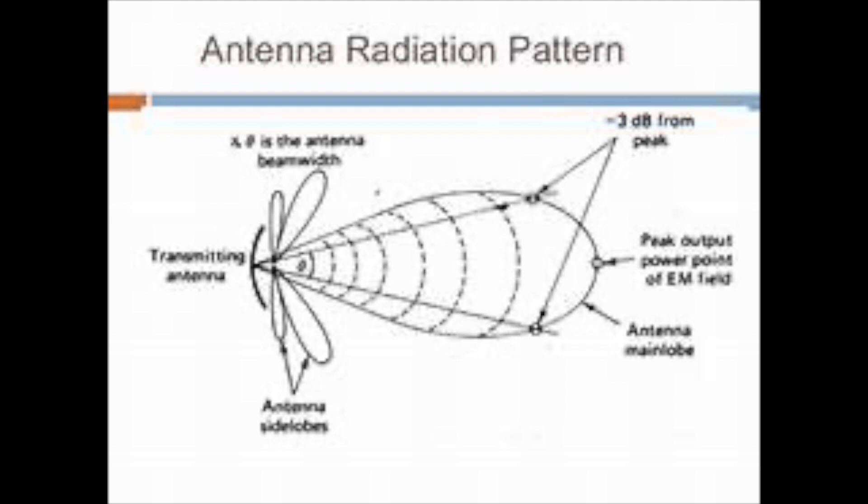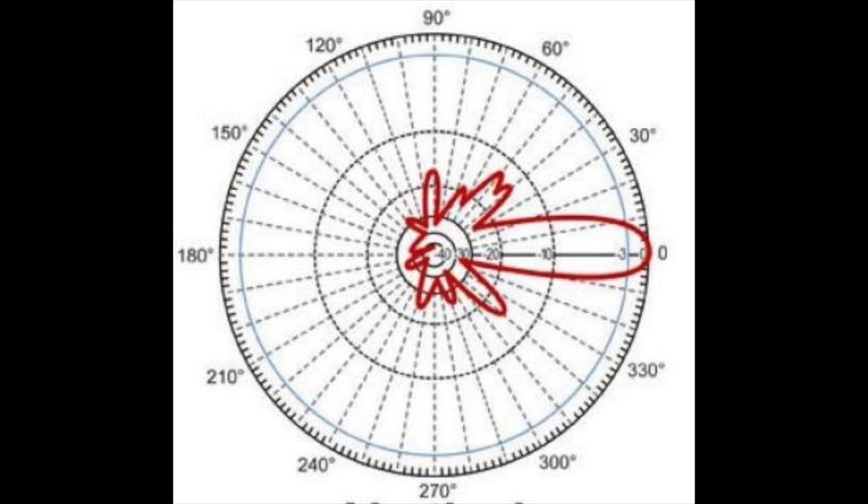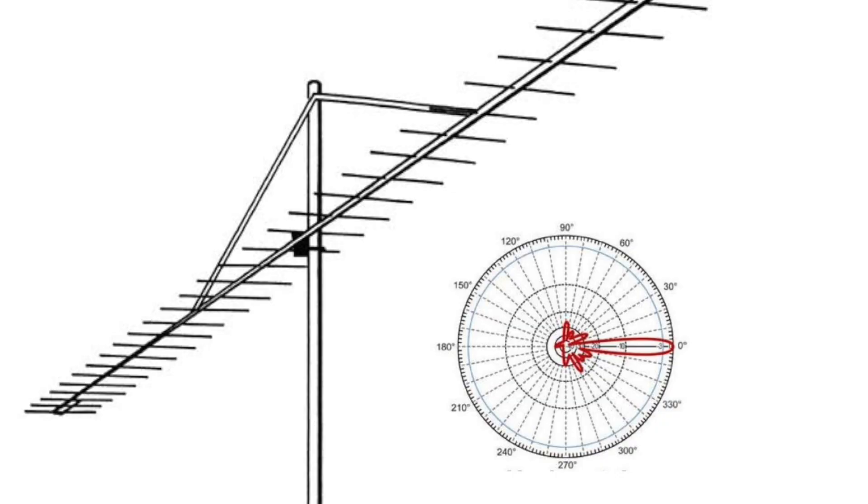Here's the radiation pattern. It also works on receive the same way, but it affects the pattern of where the energy goes. As you can see, in a six-element beam you have a lot of side lobes, but when you add more and more directors, you get a more directed beam — pointing more in one direction.